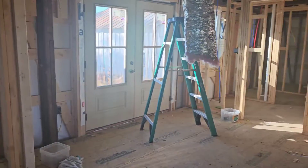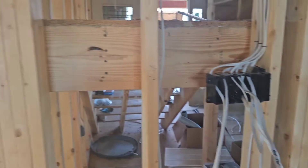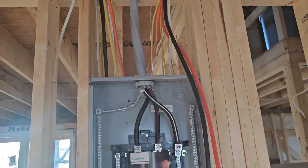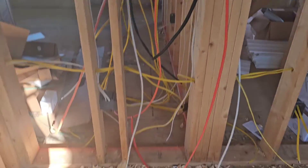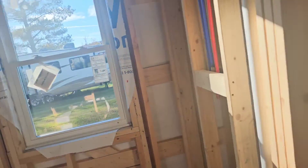Now going through here, we're going to head over into this area where the panel is. We'll stop and look at the panel before we move on. He's going to have to check his box fill on all these like we talked about. Got nice 14 gauge home runs coming back. He's going to fire-caulk everything, air-draft everything. Coming on through looking good, and as we come around here he's going to do a can fan there. Everything has been wired very well.